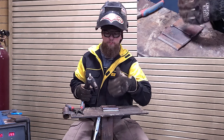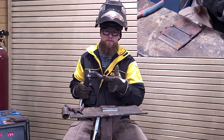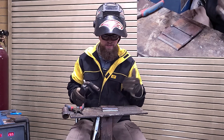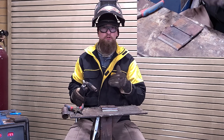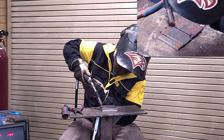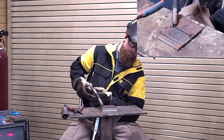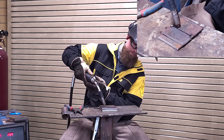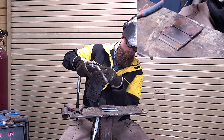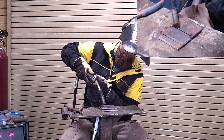We want full penetration in a single pass from one side — we're not going to weld the backside. The idea is that the weld will seep all the way through and fuse the entire joint. I have it on the 3/16 setting with an eighth-inch gap on quarter-inch metal. We're going to keep the gun pointing straight down, start right on the tack, pull the trigger, and move right down the center — not favoring one side or the other. I do a dry run first. I sometimes prop one elbow on the table or on my leg to help stabilize as I go down.